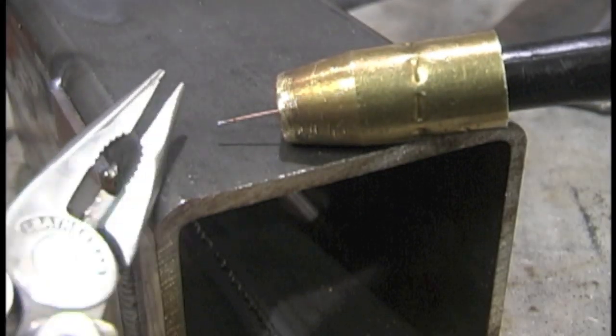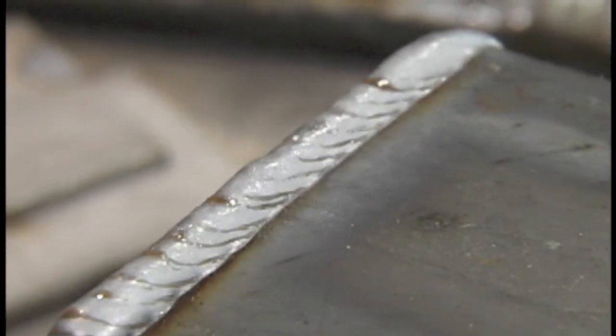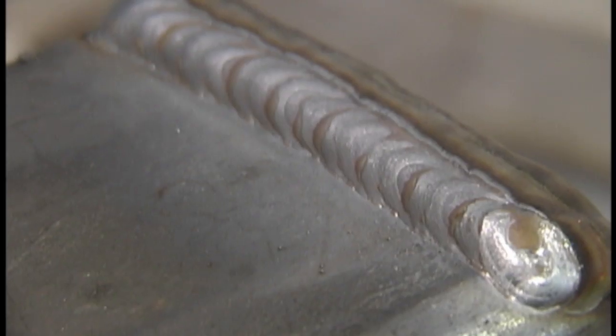The next exercise is to cover a small plate with weld beads. The pamphlet says approximately a 3×3×quarter-inch-thick piece of metal, but counselors will need to use some discretion since people aren't always going to have pre-cut metal. Here I'm using a piece of 3-inch square tubing with about quarter-inch wall thickness — it serves the purpose just fine. I put one bead on the very edge first and try to keep it straight, then overlap them. The merit badge requirement is just to cover the plate with beads, but in welding school you'd pad beads stacked exactly halfway with no deep valleys.